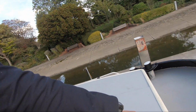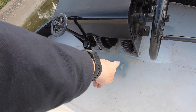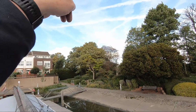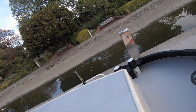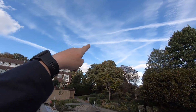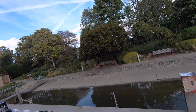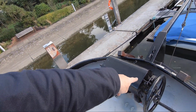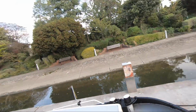But a single cable down to the winch isn't enough mechanical advantage. So we're going to put a double block on each side, and the yard have also welded on two mounting points on the deck here. So the cable will go from that mounting point all the way up to the A-frame and round the block, then it'll come back down round a block on this one, and then it'll come all the way back up again around the block a second time on the next wheel, and then it will go down to the winch here, and so you'll be able to crank it up. They've also provided me with a pole to use the brake there, because the winch didn't come with a brake pole, so that's really nice. So I think that's it. That's a kind of rough tour of the stuff that we've done.